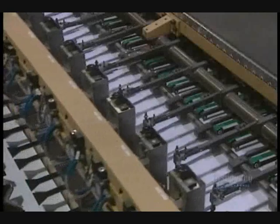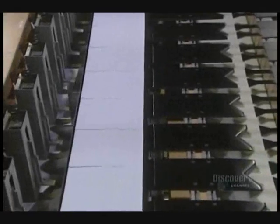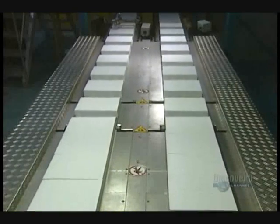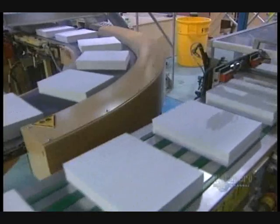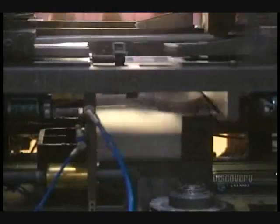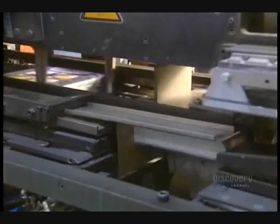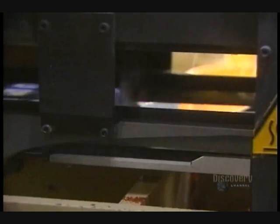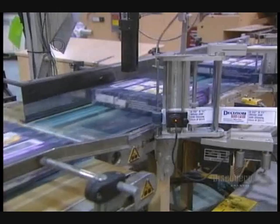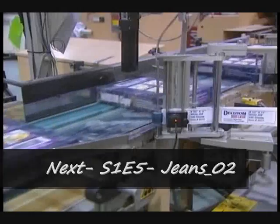Production reaches 55,000 sheets per minute. We see here the transfer section of the cutter. 4 automatic catchers and operators verify paper quality before packaging. In 1 hour, this mill produced 6,600 packages of copy paper. A single log allowed for the production of at least 15 packages of copy paper.